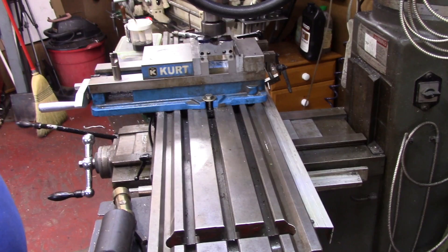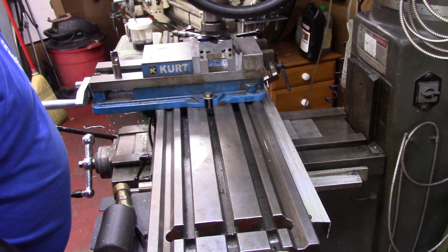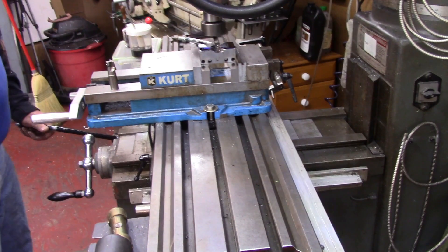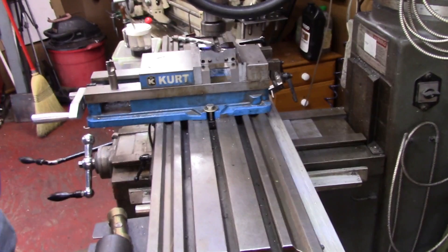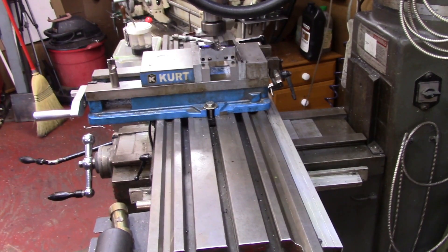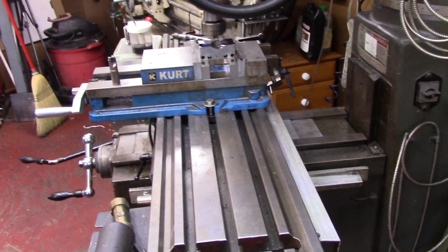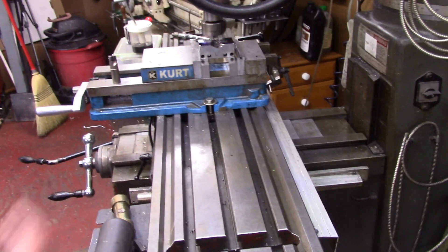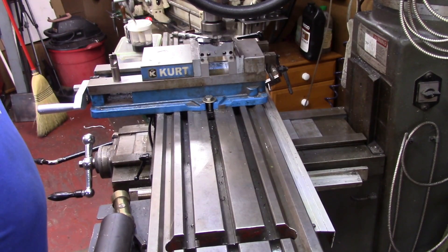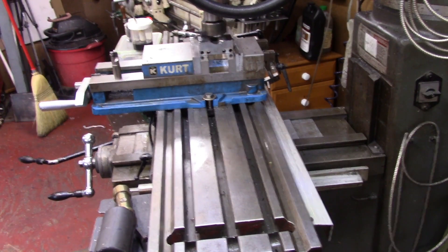Now you see why I'm doing it — because I'm not on the same plane. This is why anytime you warp this stuff around from welding or machining it, you need to check. I'm just taking about 10 thousandths — I don't want to take much off, just enough to clean it up. I already milled it once to get rid of all the imperfections of the welding, so now this is just cleaning it up to make sure everything is squared. This is actually probably more important in this project than in a standard cut-and-dovetail.